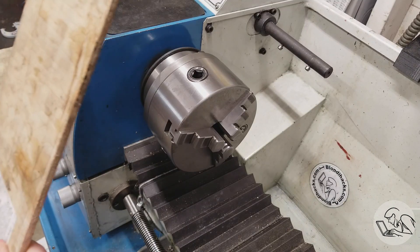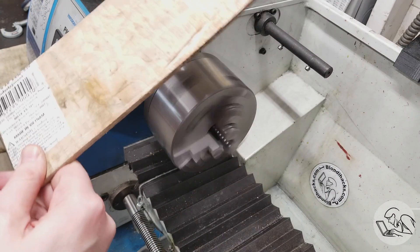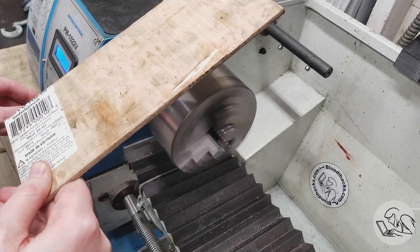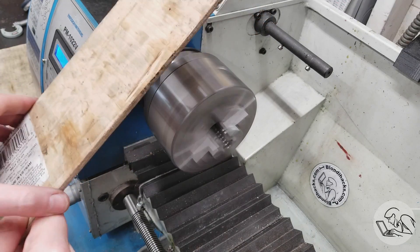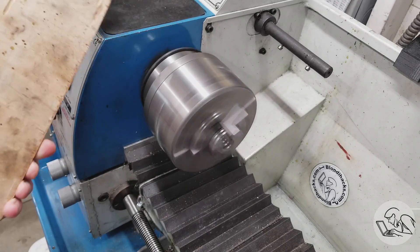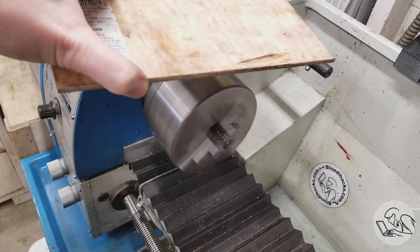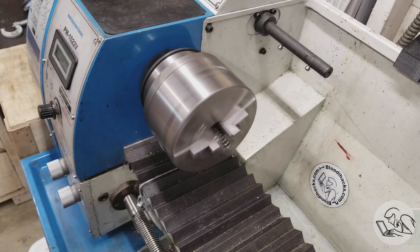Let's reinstall the chuck now and test things out. I'm going to make sure all the mating surfaces are nice and clean and then carefully line up the marks on the chuck. On this lathe the backing plate and the chuck spindle are also marked so those line up the same way, because once again the chucks are ground in situ on the lathe in final assembly to get as much concentricity out of cheap components as they can. Now let's spin it up, and if you used oil like me, go ahead and put a board in front of that chuck and spin it up to maximum speed to spray the worst of the oil out. It is going to spray oil at you for quite a while — everything in the plane of that chuck, the wall, the floor, the ceiling, your face — is going to get a nice little ring of oil droplets.